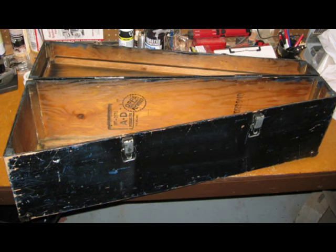A mistake I think a lot of people make when they're fabricating road cases at home is that they just go out to the hardware store and buy hinges and latches there. And if you do that, you find out they're almost always very cheaply made, made out of soft materials. They're of types that don't work well and hold up to heavy handling, not very strong, just very inferior hardware, and you can get much better stuff without spending a lot of money.